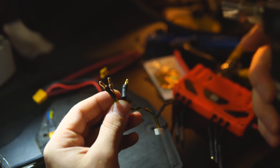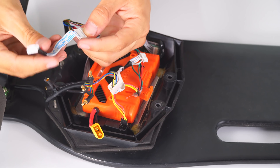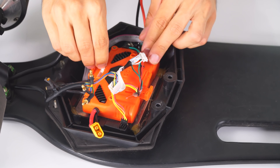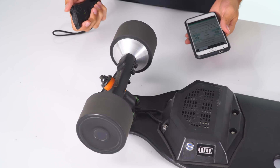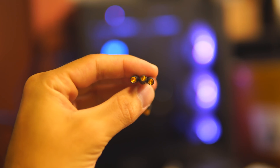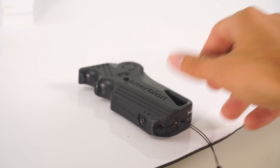The way we swapped it out was really quite simple. We used the included bullet connectors that come with the Unity to change the motor connectors. Then we made a simple DIY sensor cable adapter and re-routed the cables so that the sensor cables lined up with the Unity plug. Once everything was plugged in, we ran the motor detection on the Unity and we were good to go. We also created a motor cable adapter so we could hot swap the ESCs, but if there's enough interest we could look at making a specifically made adapter for the Unity so you can do this at home without having to worry about soldering anything.